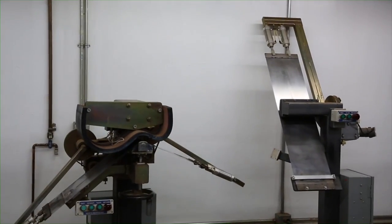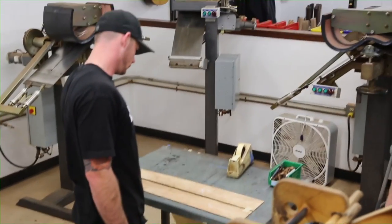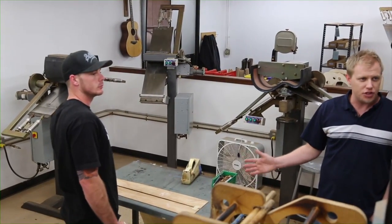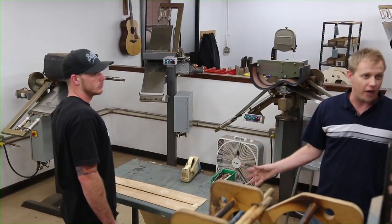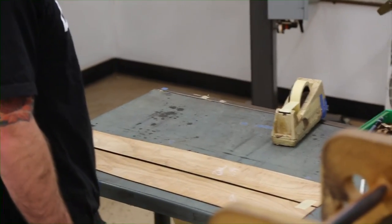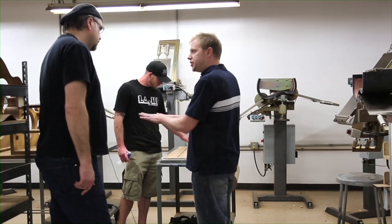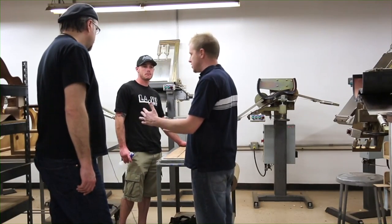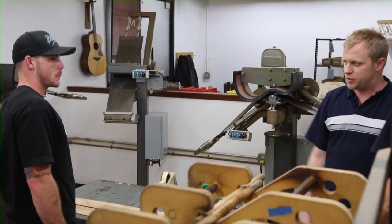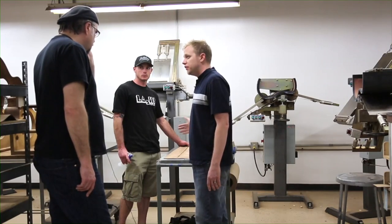What Vaughn's doing here is he's prepping a set of sides to be loaded into the bender. Our sides come lasered from the milling department, and each one is lasered to an exact specific shape, length, and profile. We put them together with a couple of locator tabs, which are also lasered out. There are notches lasered into the sides for these locator tabs to position the two sets of sides together — both the upper bout side and the lower bout side — in the exact place we need them for the waist to be bent, and in the correct position relative to the overall length of the sides.